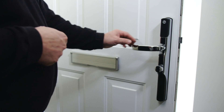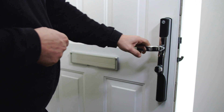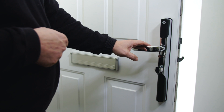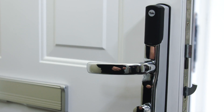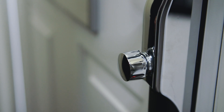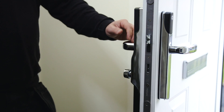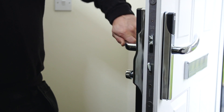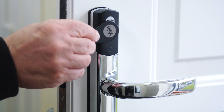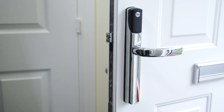Before shutting your door in the frame, please test the following. While the door is open, lift the lever handle to lock and make sure the motor operates smoothly. Test to make sure the lever handle cannot be pushed down. Push the thumb turn in on the inside handle and turn 180 degrees to unlock the door. Push the lever handle down and make sure it returns by itself. Lift the lever handle to lock again. Tap one of the paired cards or tags on the outside handle under the Yale logo and make sure it unlocks and the lever handle can be pushed down.